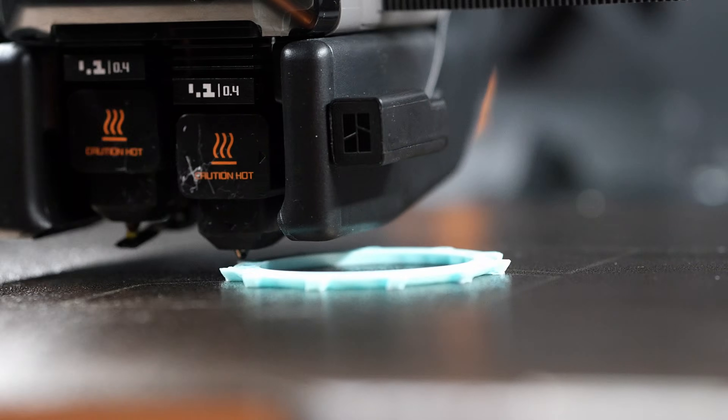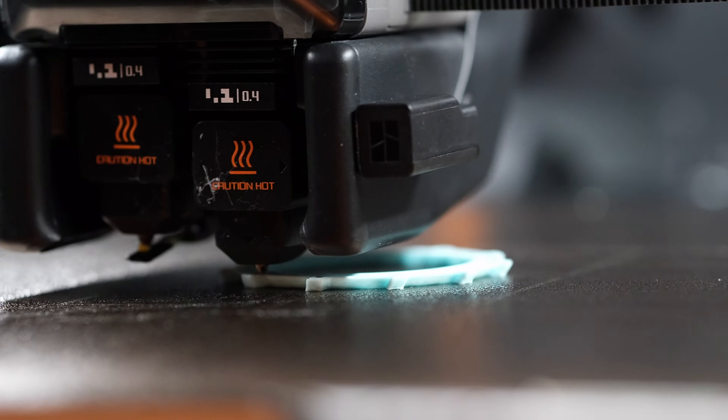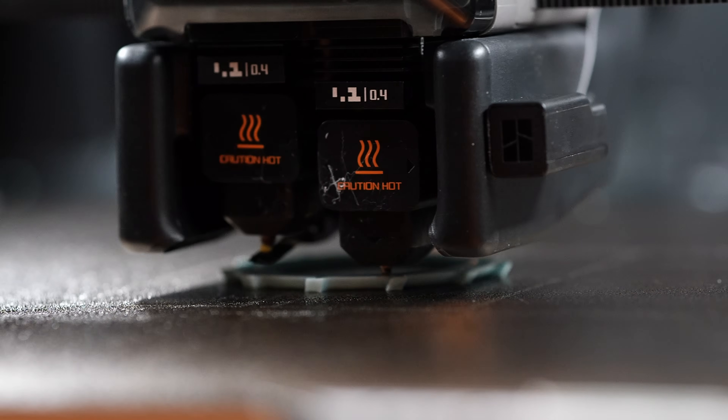This is not a comparison video, so I'm not going to be comparing my X1 Carbon and P1Ss to my H2D — I'll just mentally compare print results with stuff I've gotten in the past. Generally speaking, if you've got really dry filament and you print really slow with TPU, you can get some excellent results. Also, the extruder system on your printers plays a huge role in how the TPU prints.